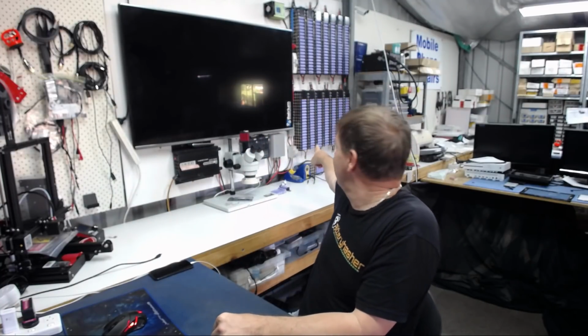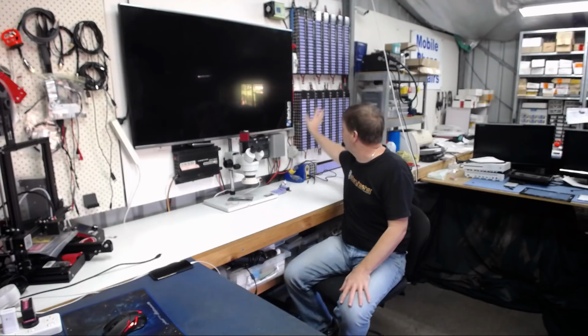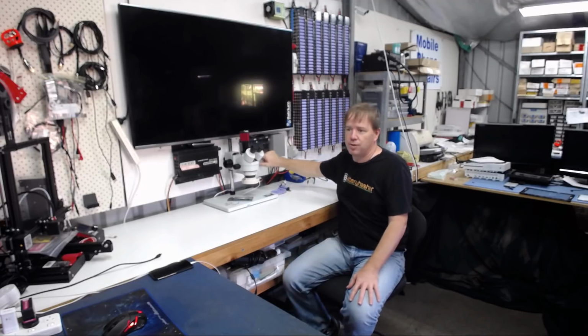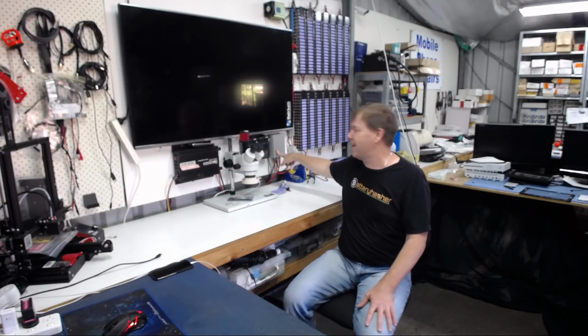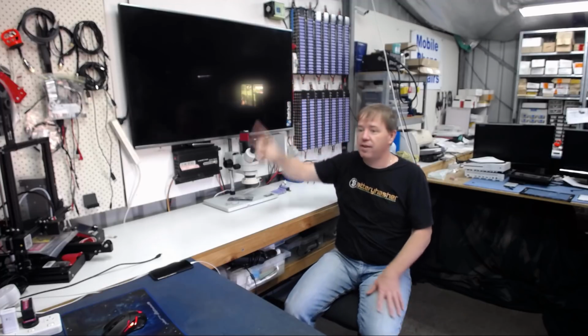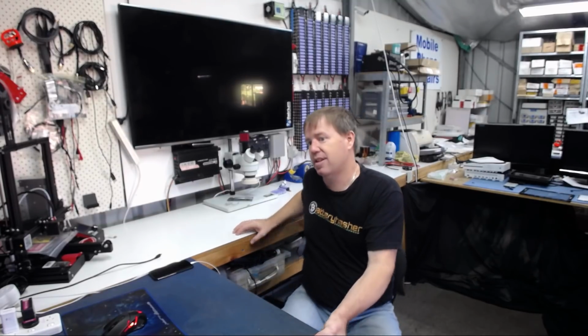How's the battery hasher going? Have you made much? The battery hasher is currently, and has been, not used for quite some time. I get it out every now and again, but the power supply is actually here. For many months, this power supply was, so this is 48 volt. I got the charger up there, 1 kilowatt of panels on the roof. So this was running my 2 Opus chargers that you can't really see, and this 12 volt 1500 watt inverter, even though you couldn't pull 1500 watts through it because this maxes out at 60 amps. There's an LED light above, so it ran the light. It ran the 3D printer when I was running it, and it ran a lot of the Ryobi chargers and stuff like that.